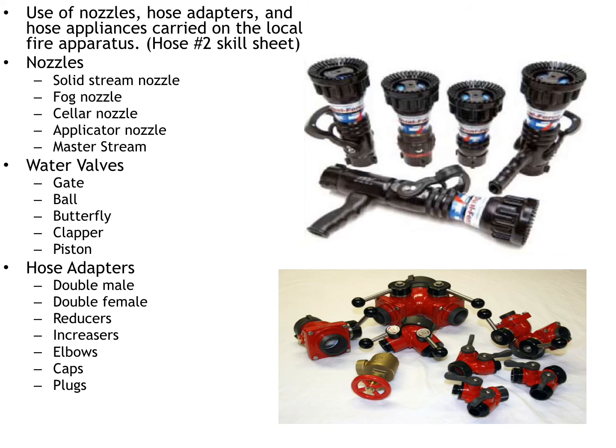Now, a smoothbore nozzle is a nozzle that just attaches to the actual handheld portion of the nozzle, and it's just going to shoot one type of stream of water out of the nozzle. It's literally a straight stream of water. Now, we do have some larger nozzles, and those are called master stream devices, and those are typically going to be found on the deck gun, which is going to have a smooth bore, or our blitz fires, which may have a smooth bore or automatic nozzle attached to it. Again, we're going to go into detail on how to use those when we do the skills portion of this class.